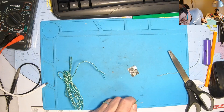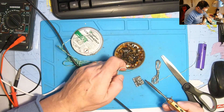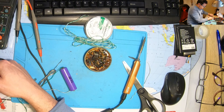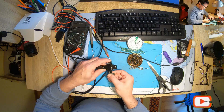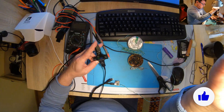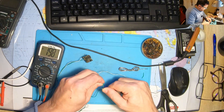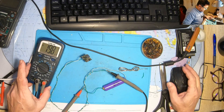We need some wires and a soldering iron. Battery plus — I have the green color on this — plus goes here. In the meantime, while I'm finishing the setup, let's put it to charge. We should see a red LED. Let me check the charging current — we have the charging light. It's charging with 0.38, almost 0.4 amps, almost 2 watts of charging. Let me check the standby current — we have around 200 micro amps. This is the standby current of this device, which means almost nothing. It can be on standby for months.